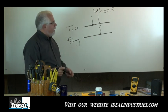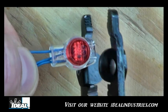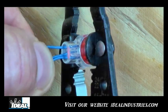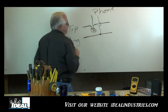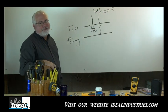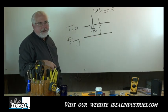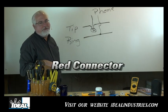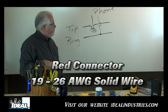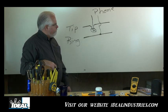If you're doing this with a jelly bean connector, you would cut the conductors here — you'll have two ends that go back together, plus a third conductor going off to the new phone. That's essentially what the red jelly bean connectors do: they tap a line. The red ones handle 19 to 26 gauge cable — a little bigger range than the yellow and blue — and you could probably fit 18 gauge and it would work, but they're rated for 19 to 26. Those are taps.